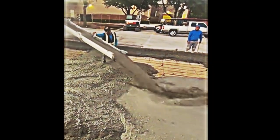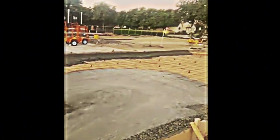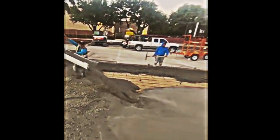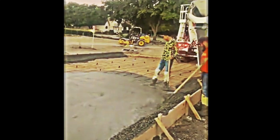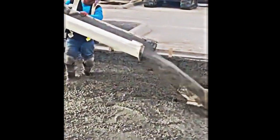And we're off, boys. I wish I was there when I listened to these guys strategize this pour. Get a load of the curb. They freehand it with, it looks like 1-inch rock, and they probably poured that at a 3-inch, and they did a good job shaping it just by the look of this work. And then we're going to shoot this water with 10% water reducer, right?